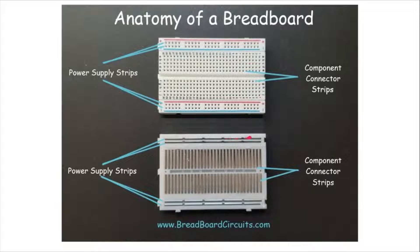This is the back side of the breadboard with the conductive metal rows shown that correspond with these rows of holes. This is your positive rail right here; this blue one would be your negative rail. The same applies on the bottom — this would be your ground and this would be your positive, so you have a positive and negative on both sides, which makes it easy to connect components to both rails of the breadboard.